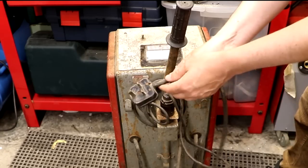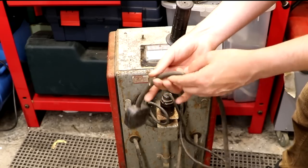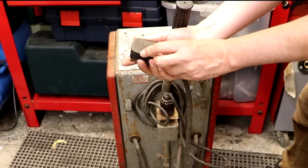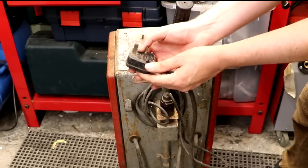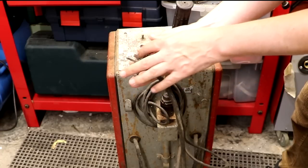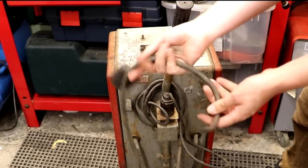The battery charger is designed to plug into the mains, and we've got a rather thick rubber mains cable — the rubber has really suffered and we're going to have to replace it. It's also got a plug on it: I think it's made by the Mabo company, made in England, with a BS 1363/A stamp on it. Interestingly, the plug is old enough that it doesn't actually have shrouded live and neutral terminals, so we should replace this plug when we replace the mains lead.